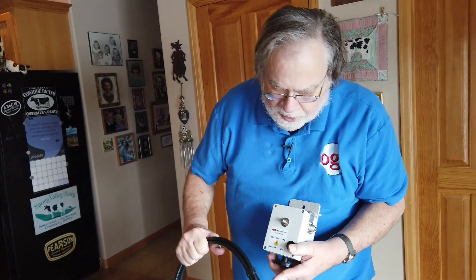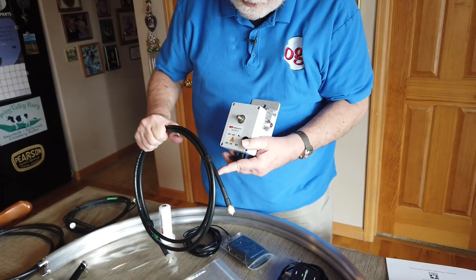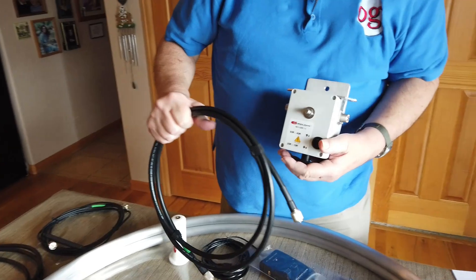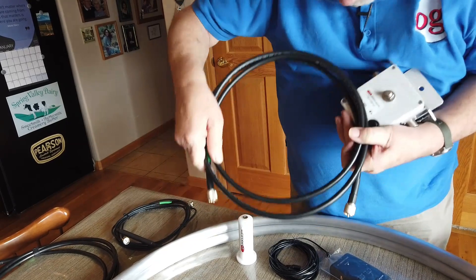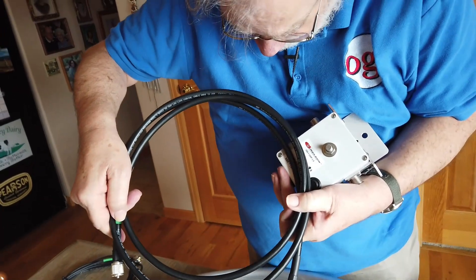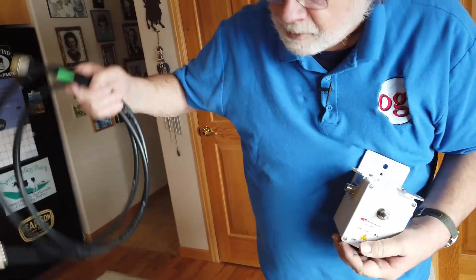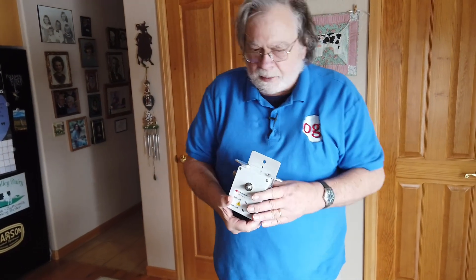You can use a coax antenna — the only thing that's important is the outer part of the shield. Because of the skin effect, it's not going to go down into the shield very much. We're going to use the outer part of the shield. This is very high-quality coax — ABR Industries, ABRIND.com, which is one of the high-quality coax makers along the same lines as Times Microwave.